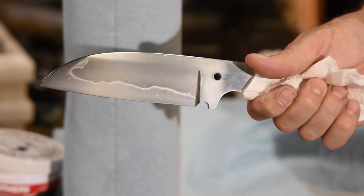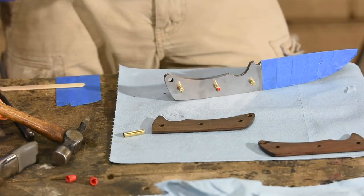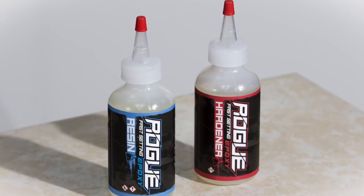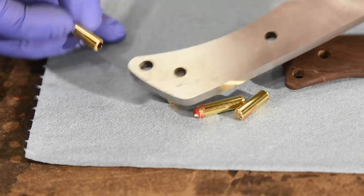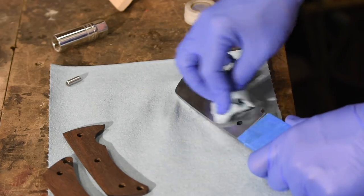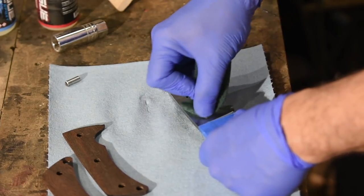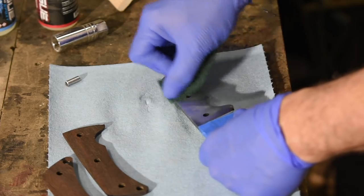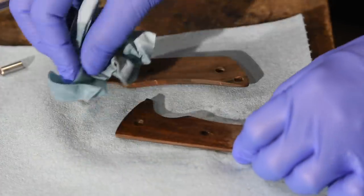So here's where that ends up. Now I'll go ahead and assemble the knife using Rogue Epoxy, provided by my faithful sponsor, Combat Abrasives. This time I'm using decorative mosaic pins as well as a brass lanyard tube. I'll use acetone to degrease the tang, then Scotch-Brite to scuff up the steel and help the epoxy adhere. Acetone also helps remove oil from the wood so the epoxy adheres better.